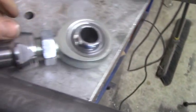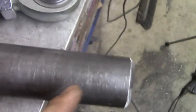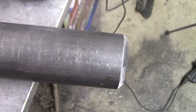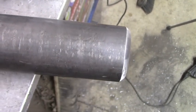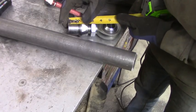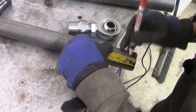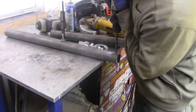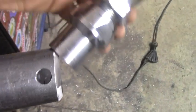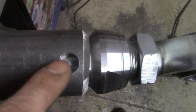Now in order to do this, it's very simple. I'm going to measure from the bottom of the taper over, find the center, throw that mark on this tubing, and then drill the hole. I'm going to drill up to a half inch hole — that way it will allow me plenty of room to get some weld in there. Here's my hole. Now all I have to do is slide this in just like so, and now I can fill that up.